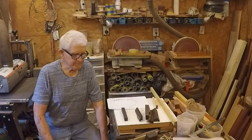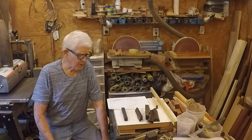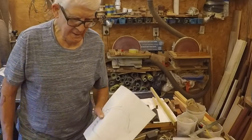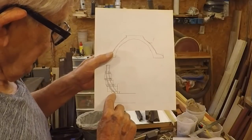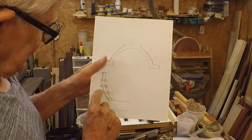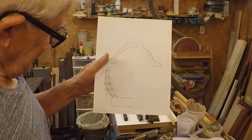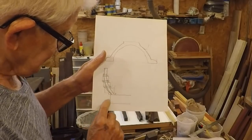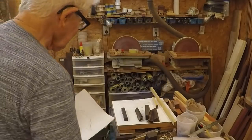I've got the base ready now. I'm using my generic drawing here, and what I'm going to do is put in a thin layer of African blackwood, then a thicker layer of yellow heart, and a thin layer of African blackwood, thicker layer of yellow heart. I'm not going to go too high with it - I'll probably end it at the third African blackwood and then put a solid ring on it. My base measured four and a half inches, so the first African blackwood ring I'm going to make four and three quarter inches, and of course it'll be open segment.